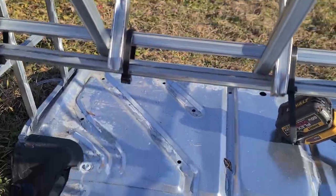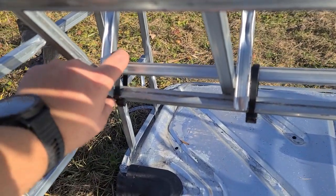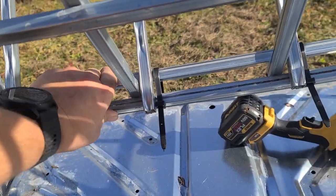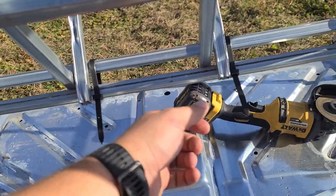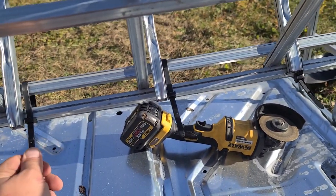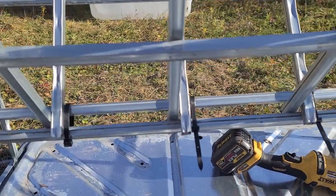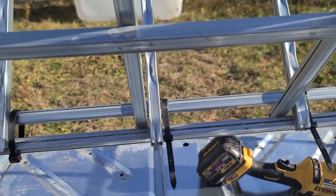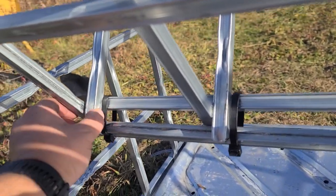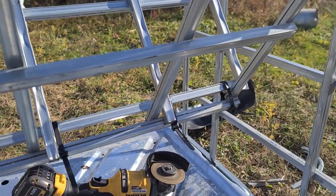I did decide to knock off a little bit of length from the arms that were sticking out, but I still left about two inches so they're overlapped. I came back through, pulled it real tight, and put some zip ties in here. Before pulling off all the tails, I worked my way all the way around, putting them on with the tails still on so I could cinch and get it tighter progressively. These are quarter-inch UV-rated outdoor zip ties. Worst case, since I left these tails a little long, I can always drill a hole and put a sheet metal screw across the bottom to hold it in place, but I think it'll be fine.